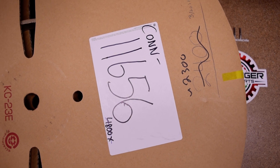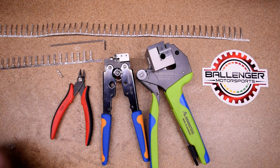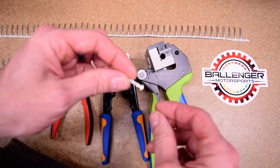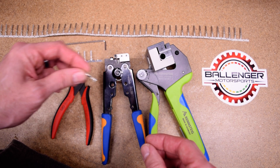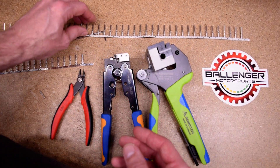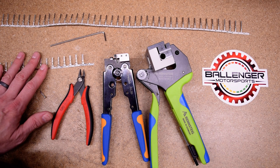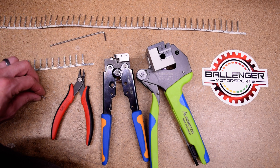This is a terminal reel and this is the cardboard carrier. Typically we have anywhere from about 3,000 to about 12,000 terminals on a given reel. An individual terminal will look like this — this is our part number 11856. This is a strip of terminals. We're going to cover how to use some basic hand tools to take the terminals from the large cardboard reel down to terminal strips and then down to the actual individual loose terminals that you need.